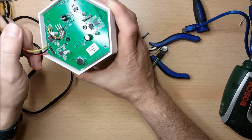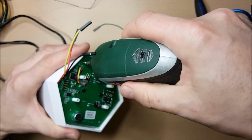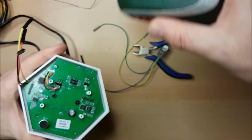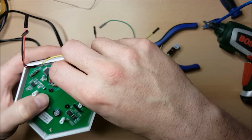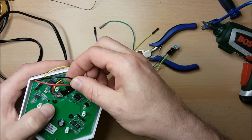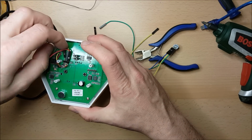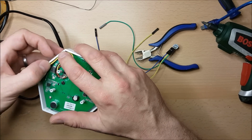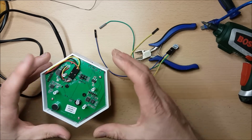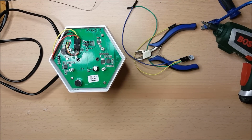I've left my 3 cables just sitting out just now. Then we'll put these 4 screws in place. And then it's just a matter of connecting my DuPont connectors, which go 1, 2, and 3. And if I just tuck these cables away, they should sit just nicely. And that's my modifications complete. The last thing that I'm going to do is program this microcontroller using a serial to USB connector, and then we'll just see if it works.